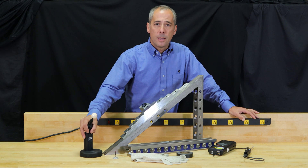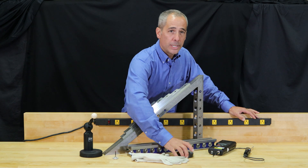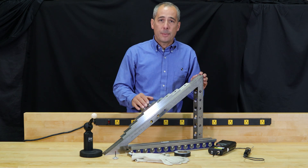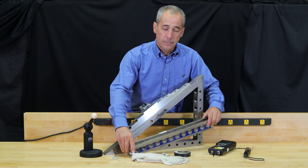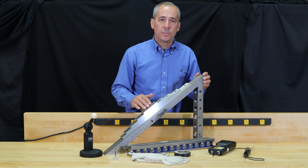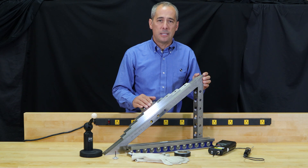The THP evaluation is done with a sphere and a ring gauge. The length work is done with a step gauge, which has calibrated lengths, or a stack of gauge blocks — it just depends on what your tech has the day he shows up.